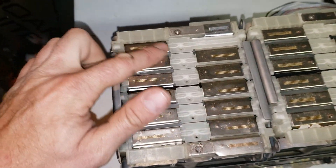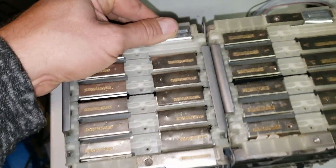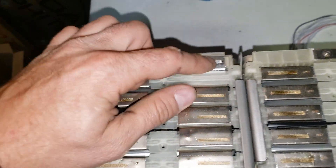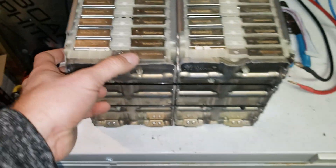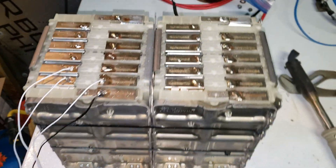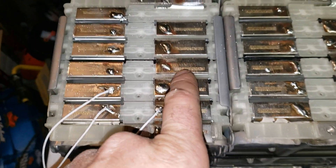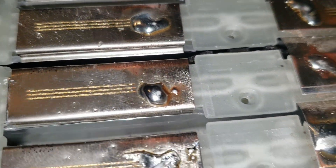I just have to wait for my soldering iron to warm up before I start. We'll see how hard it is — sometimes the nickel-coated or aluminum tabs are very hard to solder to. So far I've taken sandpaper over the terminals and sanded them well until I could see some copper color underneath.